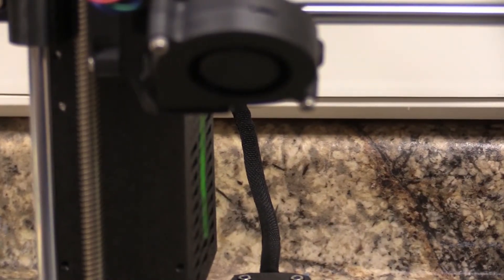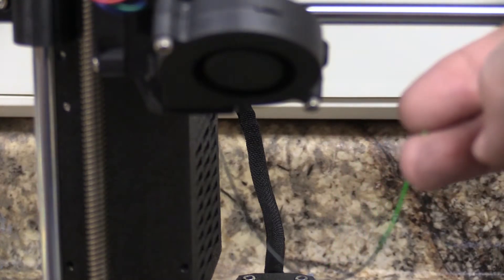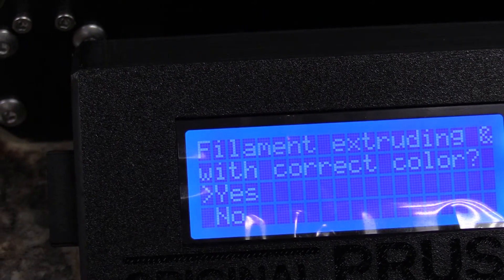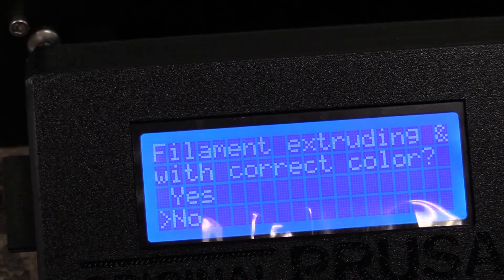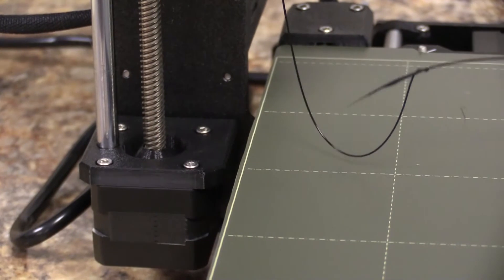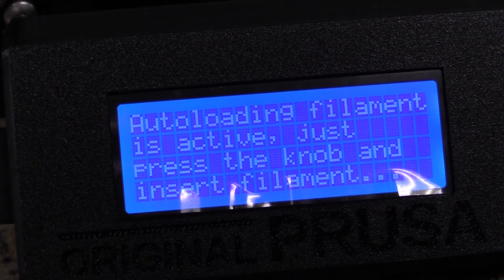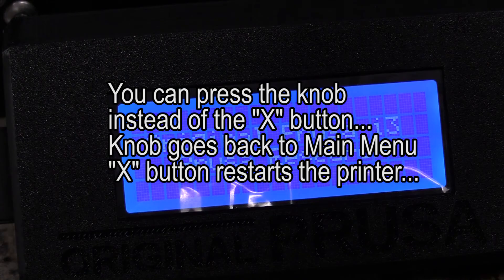So now we're going to look down here — you can see a little bit of the old filament coming out, and it's purging out the green. We're starting to get black now. It's going to ask a question: filament extruding with correct color — yes or no? So if you're putting a light color in and you used to have a dark color, it's going to take a while to get to that good color. If you hit no right here, it's actually going to extrude even more plastic out. You can hit no as many times as you need to get to clean fresh material. But once you're happy with the color coming out, we're going to hit yes, and we're done. Hit the little X button to go back.